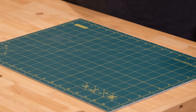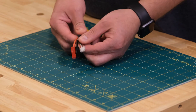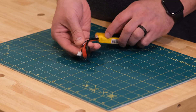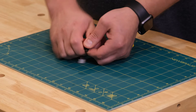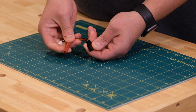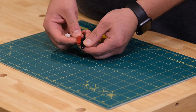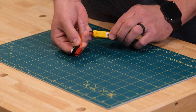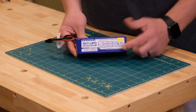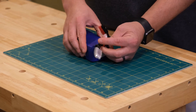Here I wanted to show you what these look like on a battery. Here is a Zippy 1000, a 2S1000. This is something I use for receiver power, especially when I'm using high voltage servos. You can see there are grooves on the housings and they slide together so you can keep them connected or pull them apart. Usually you keep these together and you have the pattern of your batteries matching the orientation on your ESC and they just click together. Here's also a Sky LiPo — when's the last time you saw one that wasn't puffed? This is a few years old, but I also use these on 6S packs.